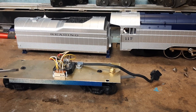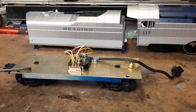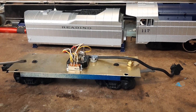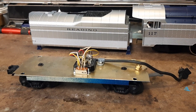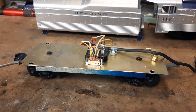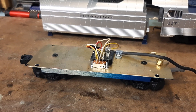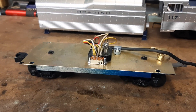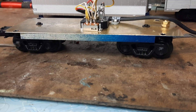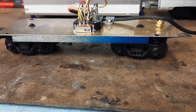The tender didn't have a base, and MTH Parts is operating again out of California, but the base isn't something that they sell. So I picked up a flat sheet of brass and made a pattern. There are notches on the back to fit in the shell, and the holes are where it mounts to the shell. I found these really nice die-cast trucks — they're not what would have been on the Crusader, but they were free and actually really nice, and quite heavy duty.